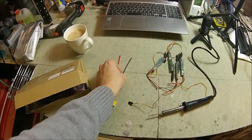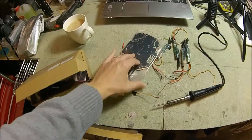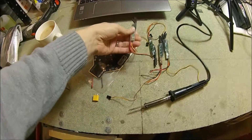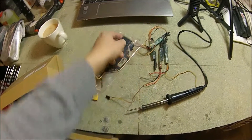I'm going to start the assembly, but before I can do that I'm going to have to do a tiny bit of soldering. I've got an XT60 connector here and two bits of cable I'm going to make a fly lead with. That fly lead will then get soldered onto some of the gold contact points on this main board here, and then I'm going to solder these speed controllers onto each gold contact around the board as well.